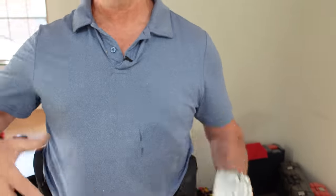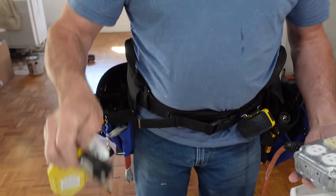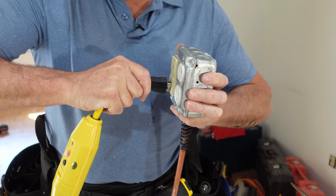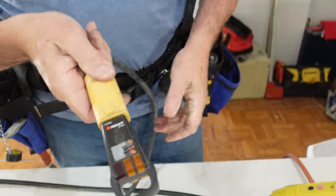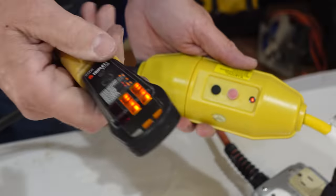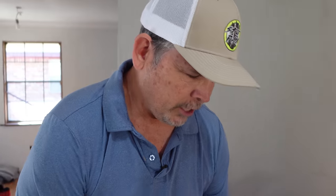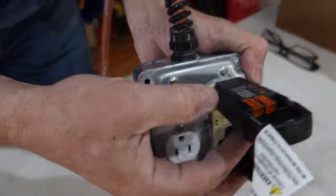We got a lot of questions about: can you plug a cord that has ground fault protection into a ground fault receptacle? This one is already plugged into a ground fault protected receptacle in the carport — we've got power and it trips right here without tripping the carport's ground fault. So yes, you can do it. But let's go one step further — let's plug this ground fault into another ground fault, which is plugged into a third ground fault. We'll press the test button and this part should trip — and it does. Nothing happened to the other ground faults, and we still have power in the carport.